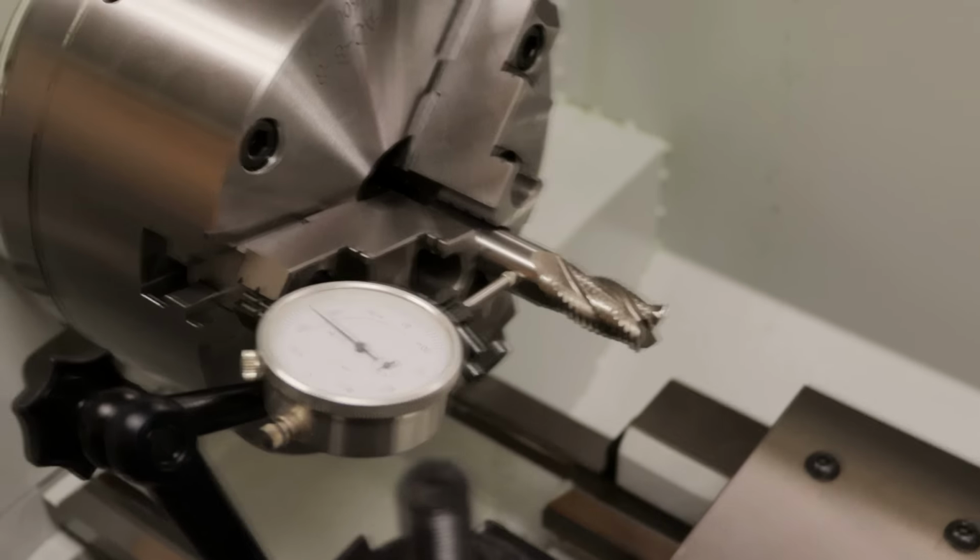All right, so the cutting speed for carbide is really high, like 400 or 500 feet per minute, or even higher. I'm going to start with 200, which makes this about 700 RPM. So that's H4, that's where I am. We'll set the feed rate. Okay. All right, contact. Backwards. Twenty thousandths depth of cut.